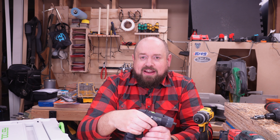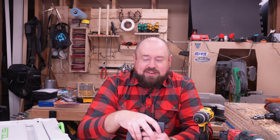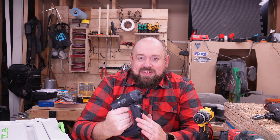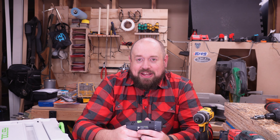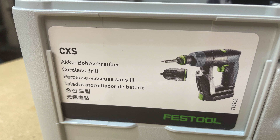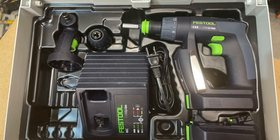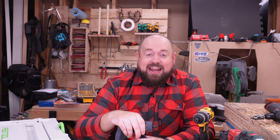Pros: it is highly ergonomic, great handle, good feel, easy to use, and very easy to pick up. There's not a learning curve like there is with the Milwaukee and that forward-and-reverse selector. This tool was designed in a very well thought-out way. If you don't love the C-handle design, they do make the TXS, which is the exact same tool with a different handle, offering the same functionality. Another pro is the Systainer system — Festool allows for future expansion into their lineup in the existing package. Ready out of the box, there are places to store the drill and attachments, with room for additional bits and accessories.